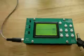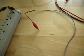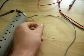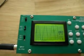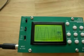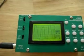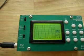The next thing is to take a look at the oscilloscope. Right now in free air we have a flat line, and we're on 0.1 volts per division. I'm now going to pick up this probe and see what it reads. We're actually somewhat off the scale — this scale is 600 millivolts full scale, and we've got a little bit more than 600 millivolts right now, so I'm going to change scales.